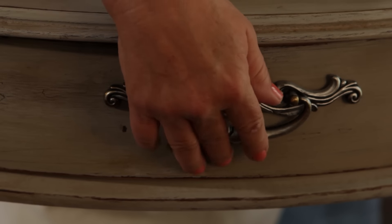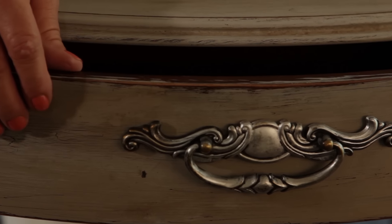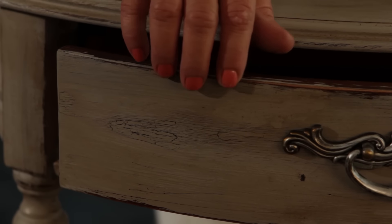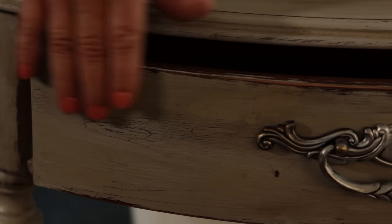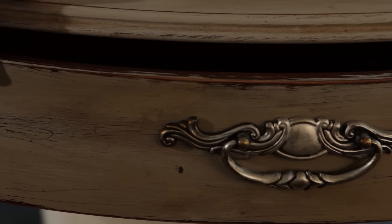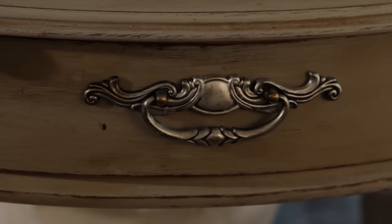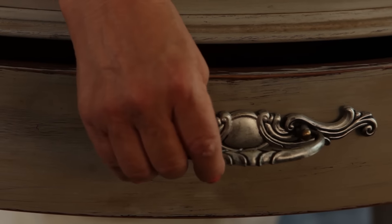Let's look at the drawer. I chose to crackle the drawer — I used black paint for the undercoat and smoke for the top coat. I really like how the tiny lines crackled. Crackling is a little tricky because you have only one chance to apply the top coat; you can't go back over the paint with the brush because the paint will start sliding off the surface. Mud paint is great for crackling because of its good coverage.